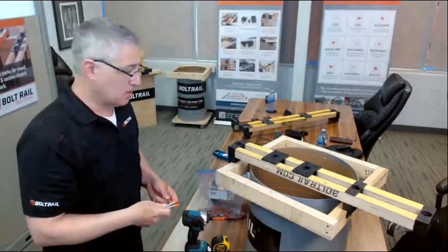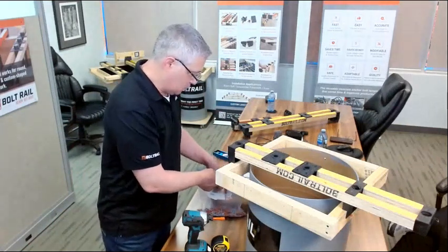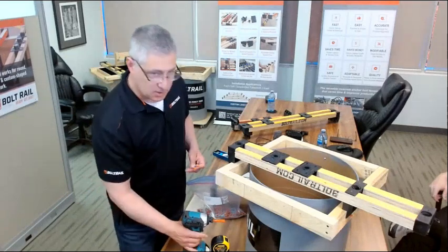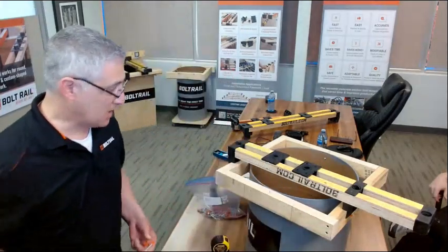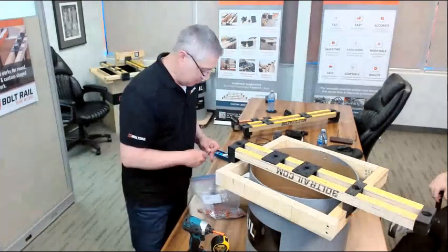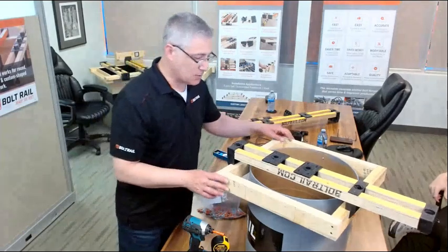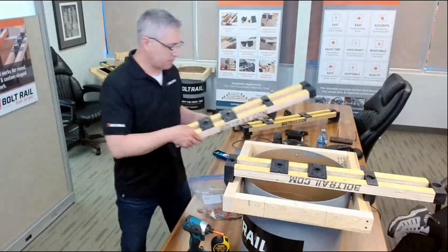Any kind of construction you're doing that requires removal or disassembly of what you're building, these are the best screws that you can use. We used to use wood screws, which would strip after a couple of uses. We were stripping drivers. Once we use these with a 1/4 inch magnetic driver, it becomes a one-handed task to put these in and out. Extremely fast. We can't seem to wear them out. We get dozens of reuses out of them. An excellent construction screw.